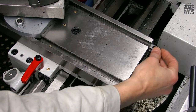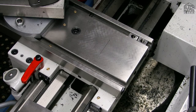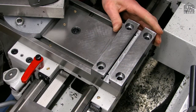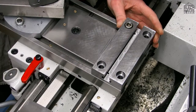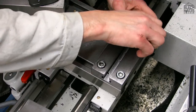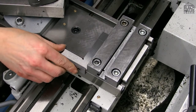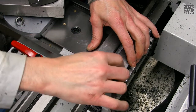First we're gonna put in the T-nuts. Then we put on the ground plate and try to hit the T-nuts with the Allen head bolts, which doesn't seem to be a very difficult exercise. Then we take a back square, align it at a right angle, and tighten the Allen head bolts.